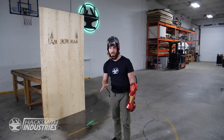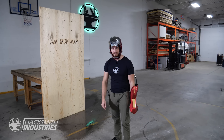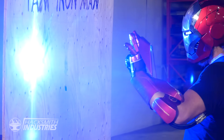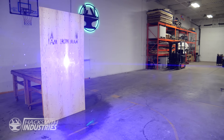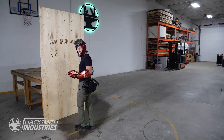Like I mentioned earlier, we're actually using a focusing lens for the first time with this 100 watt blue laser diode. That means my focus changes based on where I'm standing. This particular lens has a focal point of 1 meter, which means hypothetically I should get the most concentrated laser beam at 1 meter. If I go anywhere closer or further away, the beam is going to get bigger.